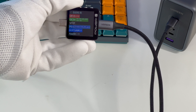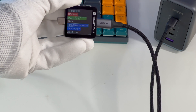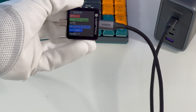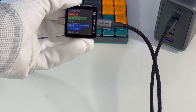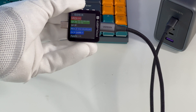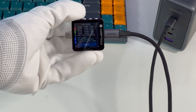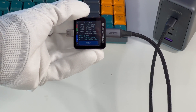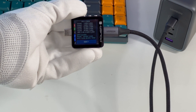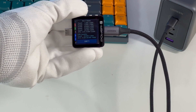After checking the size, let's take a look at what protocols it supports. ChargerLab power meter ZKM003C shows that USB-C1 can support UFCS, QC3+, SFCP, PD3.1, PPS, QC5, and Apple 2.4A protocols. It has six fixed voltages of 5V, 9V, 12V, 15V at 3A, 20V, and 28V at 5A, plus a set of PPS.